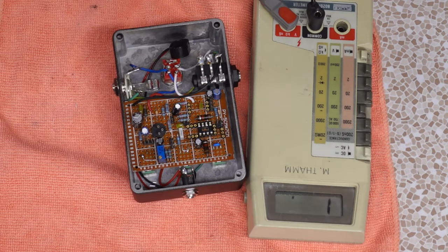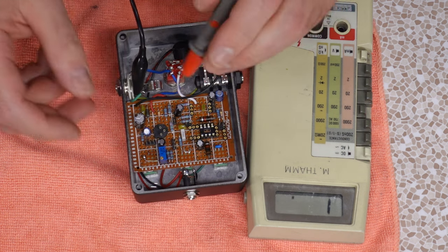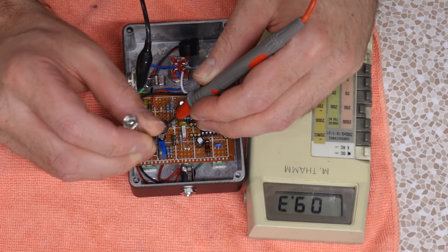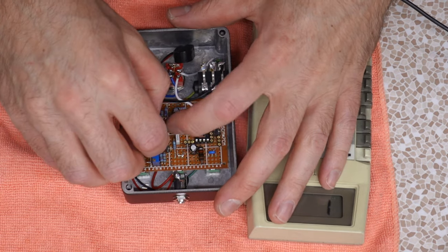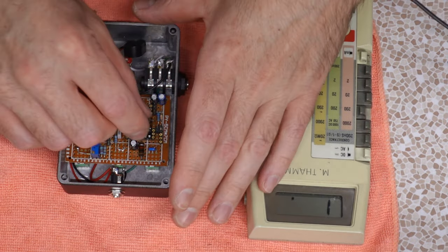I'm gonna kick things off by taking an impedance measurement. This impedance measurement is going to be from ground to the center. We're gonna dial that into 10K. Get it ready. There we go, stock value. Dialed into the potentiometer. Let us just jam this JFET into place. Oh look, it's just gonna clear the lid. And of course, we're gonna start off with an LM108.